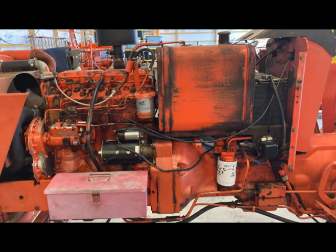I got the hydraulics all filled up. It turns out there's actually a small pump that feeds fluid into the power director inside the torque tube, and that pump also supplies hydraulic fluid down into the sump pickup we were working on — the one with the screen. I filled the reservoir, started the tractor, it pumped some fluid over, the fluid level went down, and I refilled. I had to do that a couple of times, and that got the hydraulic reservoir filled and everything working properly. That's going to conclude part three of the hydraulic system maintenance. Parts four, five, and six are coming up — thanks for watching, hit like, subscribe, and share the video.